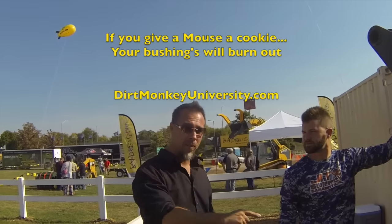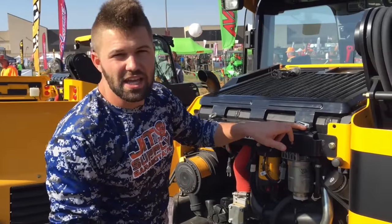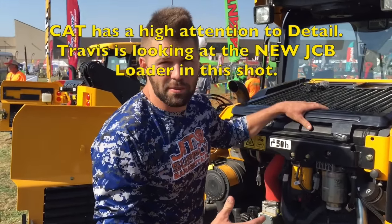No. Then what's going to happen is your pin is going to wear out. When that doesn't get changed in time, then your bushing is going to wear out. And then you've got a big bill. But something like a grommet like that matters — we figured that out with Bobcat.